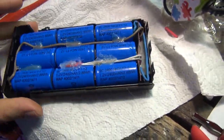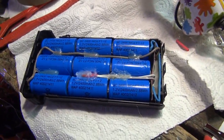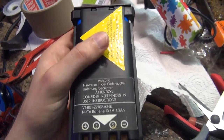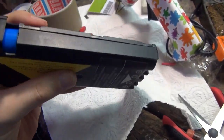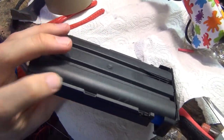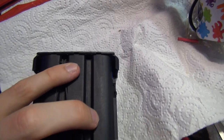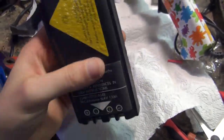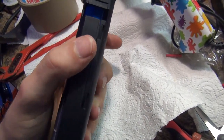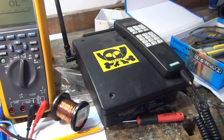So now I close this and hide the mess under this black cap. Now it's fine. I put the plastic pieces together, and once after the first successful charge, I will put some little drops of cyanoacrylate glue to these places where I had to break the plastic, and maybe over here too. I will give it a try in the real phone first, and then I finish it up with some glue. So that's basically done now. Let's now go to this one.